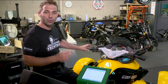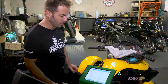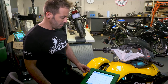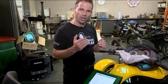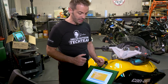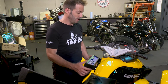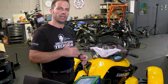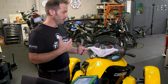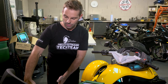In the case of two cylinders, the mbar values are normally similar. In addition, we just noticed that the battery voltage is very low — we're only getting 13.2 volts. 13.2 volts is not a lot. Many power consumers are installed on such a machine, for example anti-slip control, ABS, and rollover protection. For this reason, a large battery is installed, which must be powered by the alternator.